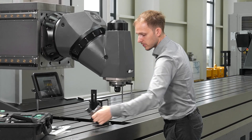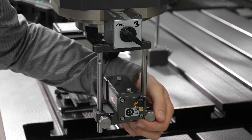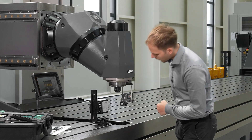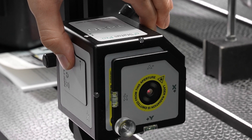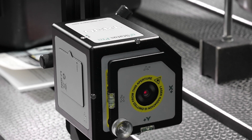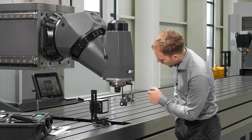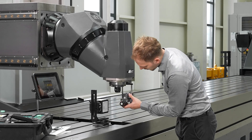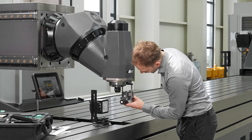This is a very easy and fast way to bring your detector onto your spindle, and you also have the possibility to align it in the height. Now we can start the laser by pressing the on/off button and put it in level. We can see it is slightly moving to find its best position using the internal level. Now we see our little laser beam and can adjust the height to get it onto the detector cap.